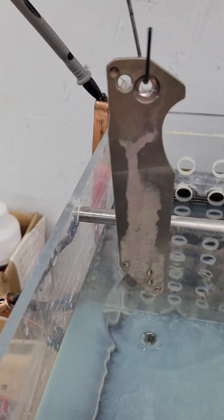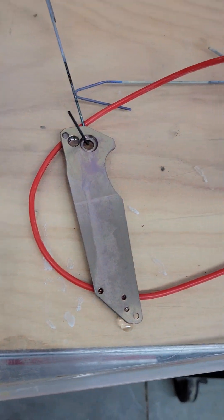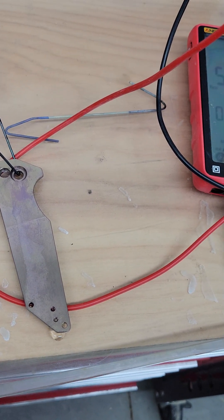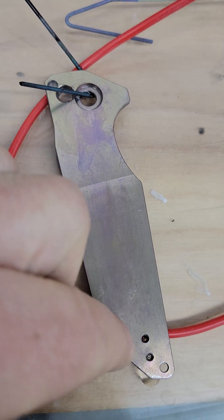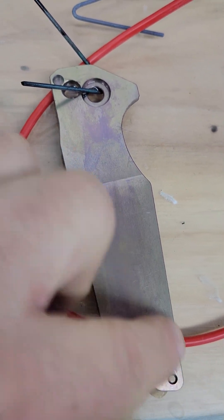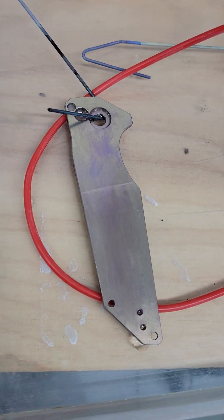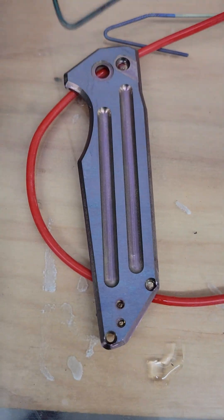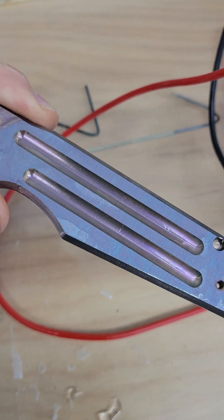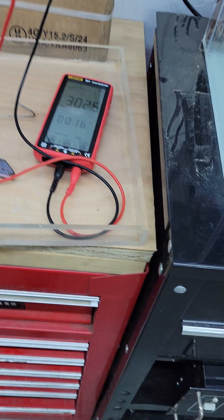Keep in mind that when you're anodizing, you're breaking water molecules down, so you get hydrogen outgassing. Those little bubbles are hydrogen bubbles — they are flammable. It's typically not something I've been really concerned about, never been enough to cause a fire. You can see the hydrogen bubbles still sitting on there. I want to test out a surfactant like some soap — I wonder if it would help reduce bubble sticking, because bubbles don't give as clean a finish sometimes. On the backside, you can see it's much more iridescent. And that's electrical anodizing on titanium.